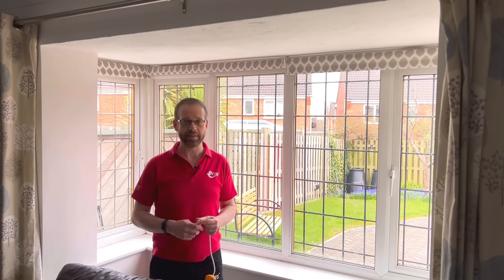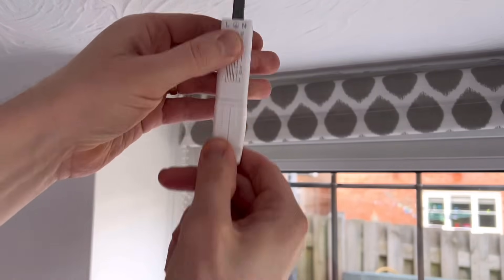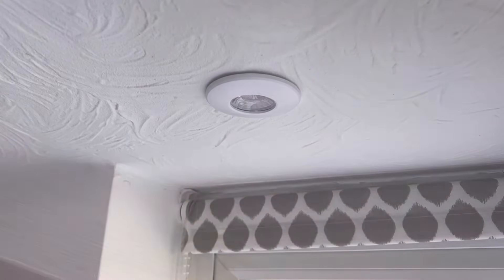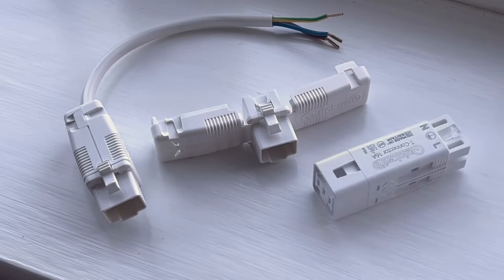You can carry out your insulation resistance testing on the circuit and the fitting won't get damaged and it won't give you false readings either. Then it's just a matter of connecting the plug and socket together and pushing the fitting home — unbelievably quick and easy to install. It's also got the advantage that the plugs and sockets for this system can be bought separately, either pre-wired with flex or just by themselves, meaning this rapid connection system can be used with any light fittings you like.